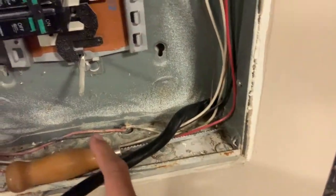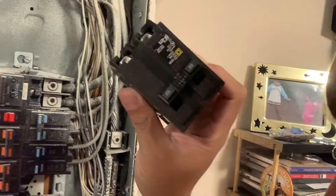Today what we're actually doing is running a 240-volt cable in order to put in a NEMA 14-50 outlet. We're putting in a 50-amp breaker, and this is the box that we're going into. We've run a 6-3 cable that has three wires plus the ground, and we've put a hole up in the ceiling to run these cables through.